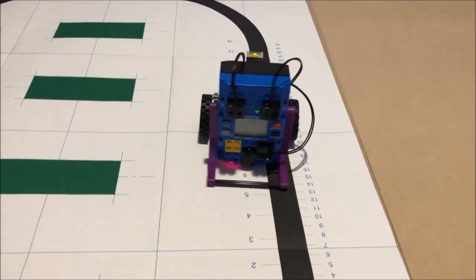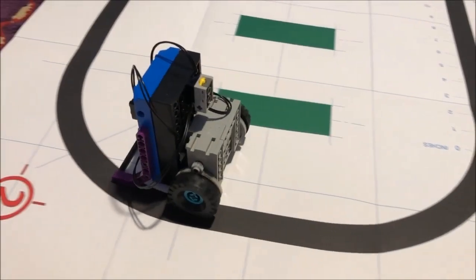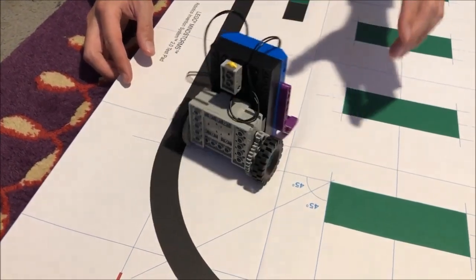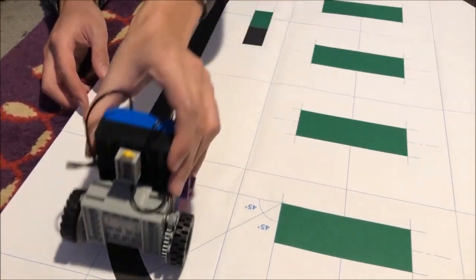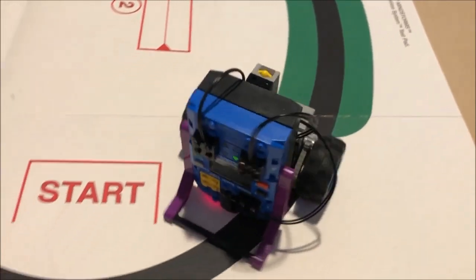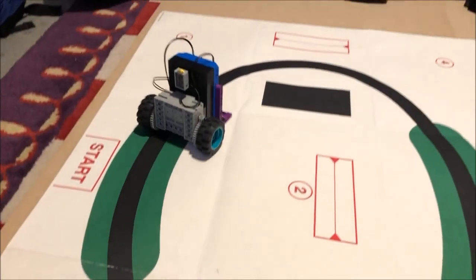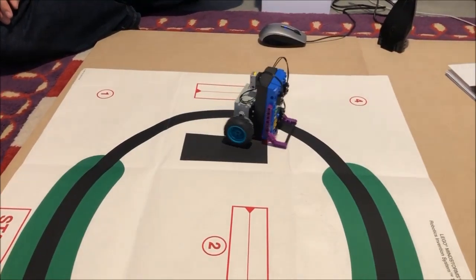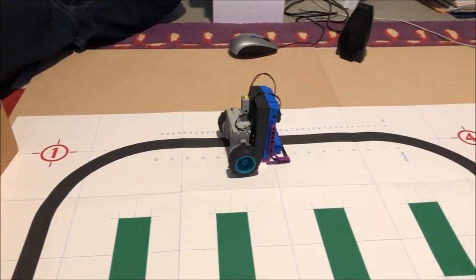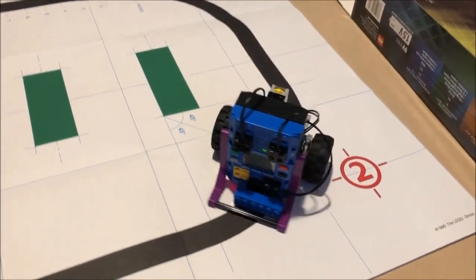On the hardware side, we found that the freestyle tires have basically no grip on the hubs and we quickly changed to the larger wheels. The poor performance of the original wheels might have some correlation to their use on the BugBot. This robot strongly felt the impact of cutting power to a motor — coasting — versus actively stopping a motor — braking. Turning by braking results in very jerky movement, whereas turning by coasting results in a much smoother path.